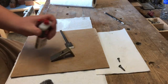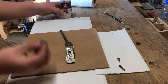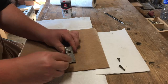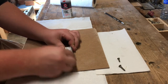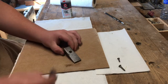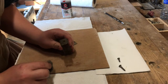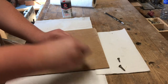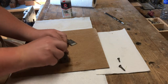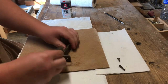I'll just take some of this and drizzle it over the part, then take my steel wool — same grit steel wool I used — and give it a good scrub. Usually you can't see the scratches it puts on, but I'd still go with the long length of the metal pieces. This will clean off all that little residual rust. Make sure you get it all down in every nook and cranny so that any water or vinegar in there gets removed by the steel wool and oil.